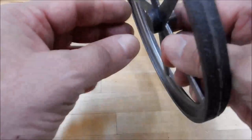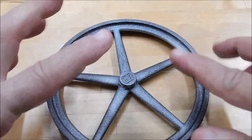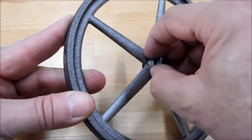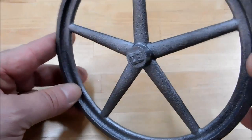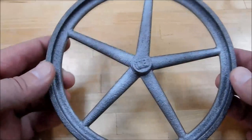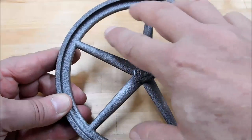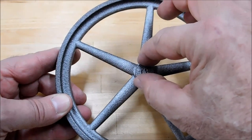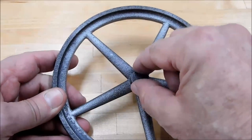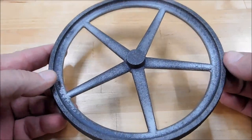You hold it on the boss, either one, it doesn't matter. Go for a visual alignment, which is closer to what you want to achieve, and dust this boss accordingly. By accordingly, I mean clean it up. Now what you have is you still have an eccentric relationship between what you want to have and what you just cut, but it's not nearly as drastic as the eccentric relationship on the opposite side. I hope this makes sense because we're going somewhere with this.